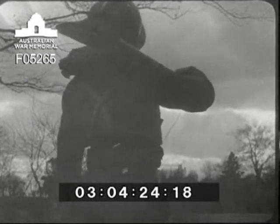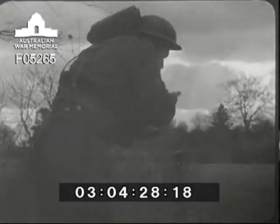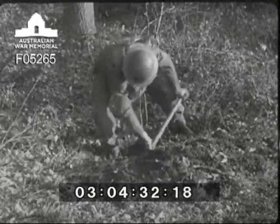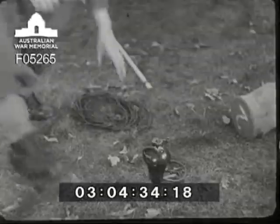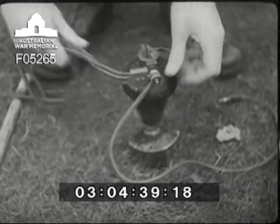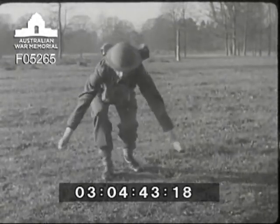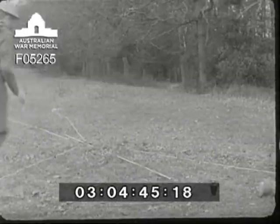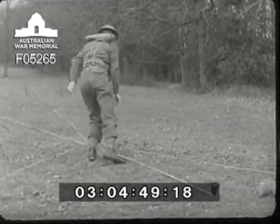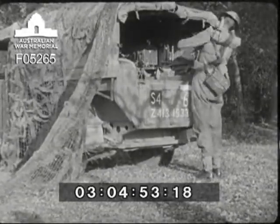The driver has finished his camouflage. Normally he'll be laying out the remote control line, but with danger of air attack he starts digging the slit trench where the set will be placed in safety under cover. Operator one is connecting the spade of the counterpoise to the insulator, which gives it a firm anchor when he's fanning the leads out. The butt end of the mast is pushed against the spike to steady it when lifting.